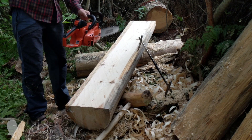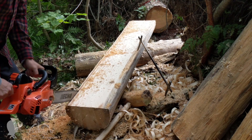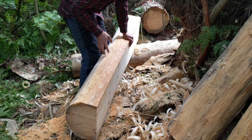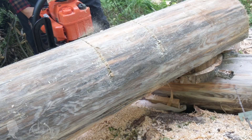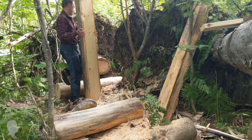The workbench's vertical surfaces are just as functional as its top. I'm planning to make a woodworking vise of my own design as well as a couple of side supports that will be attached to the vertical surfaces, which is why a 90-degree angle was critical for the bench's geometry. Because I haven't finalized my vise's design yet, I decided to cut out a primitive wedge vise at the bottom surface. Remember, I'm building a topsy-turvy workbench after all. Three cuts will remove a couple more kilos of stock — add two wedges to the cut-out perpendicular slot and you have a simple vise. I removed as much weight from the workpiece as was possible on this spot; now it is time to move it to the camp.